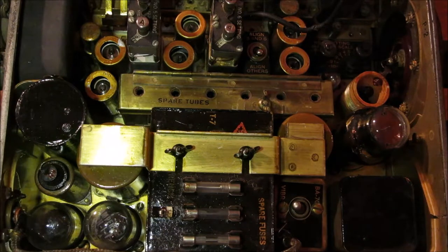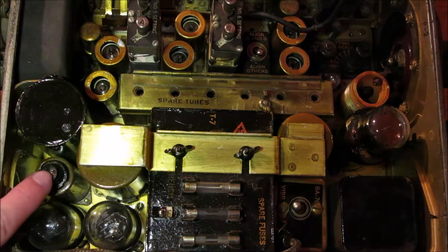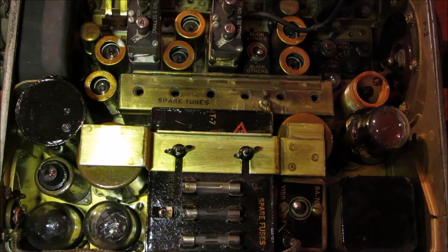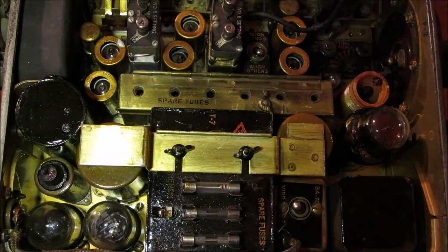While we're on the subject of power, there's a fuse in this radio that may trip you up. Half the time on old equipment from eBay or similar sources, fuses are blown just from shipping damage. Right here on this radio there's a tiny little fuse, and fortunately the one I picked up at Canton came with spares. Always check the manual to make sure the fuse is within the specified tolerance — you don't want something too big that could burn up the rest of your radio. I also apologize for the glare — this whole radio was coated in cosmoline, a weatherproof substance used to prevent rust and keep the radio in good shape in harsh conditions.